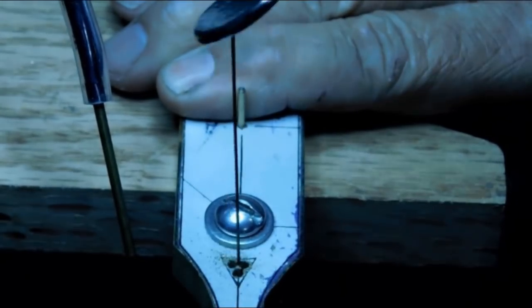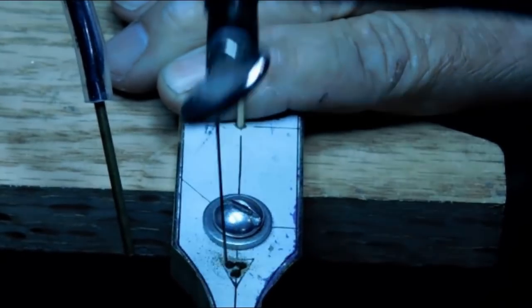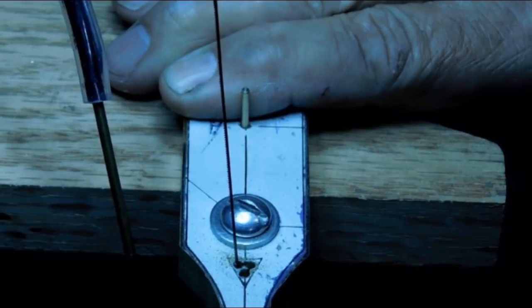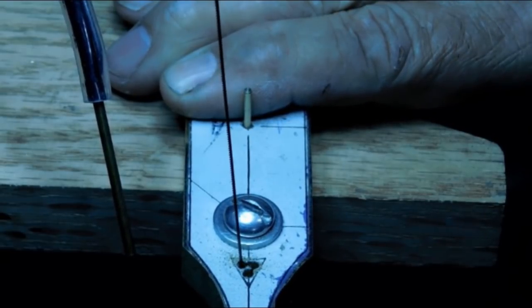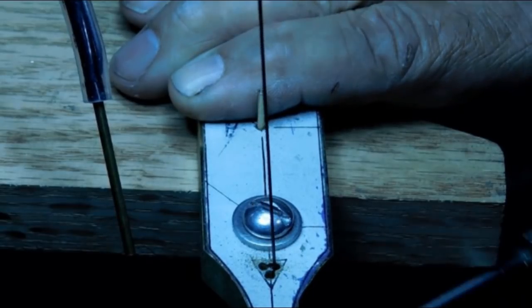The die filer will do the interior holes, and a piercing saw here. This is a thick plate, so this piercing saw is not the best. Well, I have to use it here, but I think for the bigger holes I'll go over to a scroll saw.